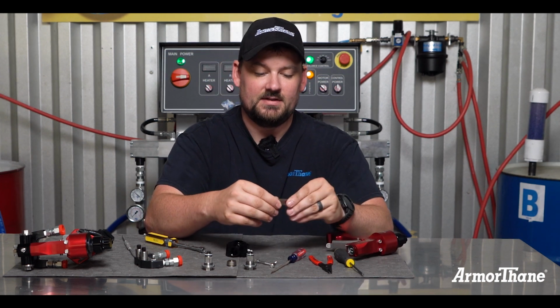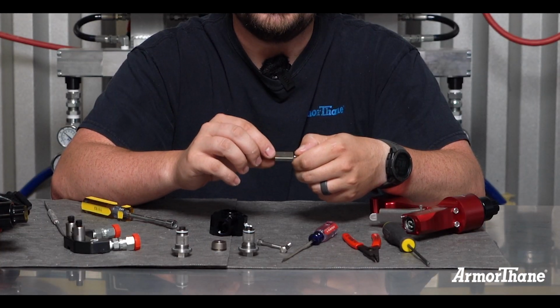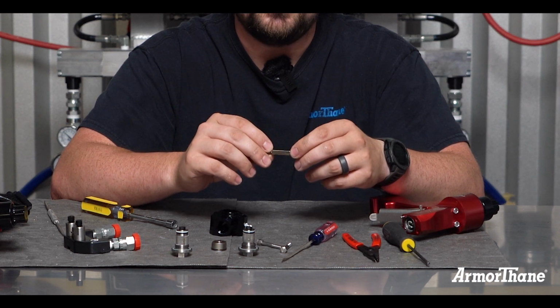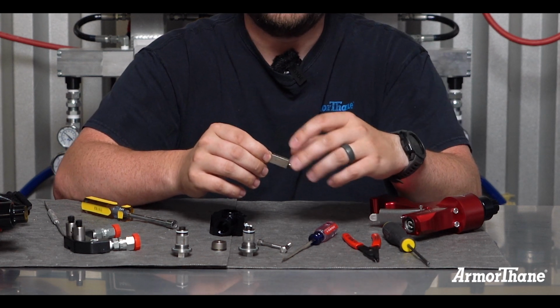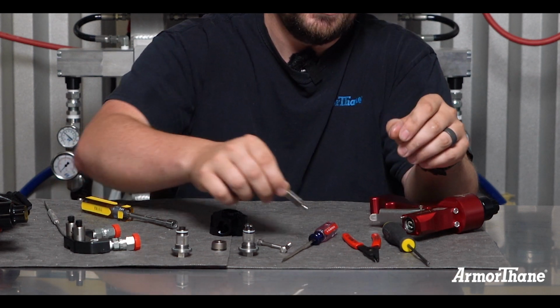And this piece as well, if you have that misting happening, it could be that you have a scratch on the surface of this chamber causing material to get by it. So if there's a scratch here or those O-rings where that injector we talked about a moment ago, you could get that misting effect. And you can refinish this with some like 600 grit paper, repolish it back out, and it should be good to go.